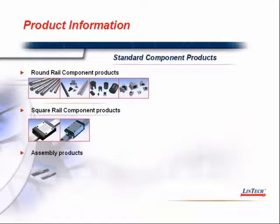Assembly products which Lintech has offered in most cases since 1970 include a fully supported shaft, SA product, or single shaft assembly. This is available in half-inch to 2-inch diameters with lengths from 6 to 192 inches. The shaft is pre-drilled and mounted to a pre-drilled support over the full length. The shaft is available in 1060 steel, 440C, and the 1060 steel can be chrome plated.